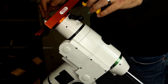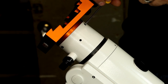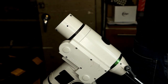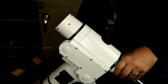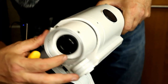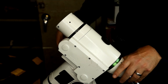The first thing I'm going to do with a three mil allen key is take the saddle off. This is an upgraded saddle — I do have a video on the upgrades I've done on the mount. But the removal of the original saddle is exactly the same; it's just these three grub screws. Once they're undone the saddle comes off. Just make sure they're not undone too much otherwise they can drop out. Some people have a lot of trouble undoing this particular part as it's done up extremely tightly, but you don't actually have to remove it to change all the bearings, so leave that in place.